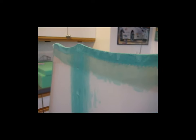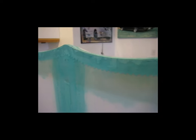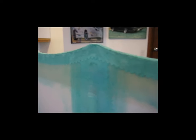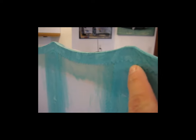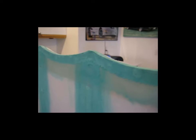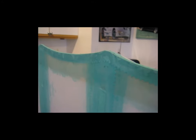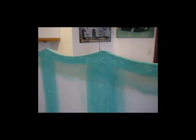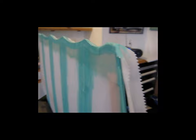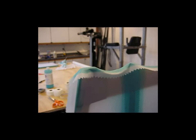I know it doesn't look like the prettiest thing on the planet because of the glue and the slop everywhere. But everything is smooth and flat, and very uniform. You can see that the spacing — the width of this tape — is consistent all the way down. Once it's painted and it's all a uniform color, it should look really nice. Let me get started on this other side and do some more gluing and shrinking and forming. And then I can start rib stitching that other elevator.